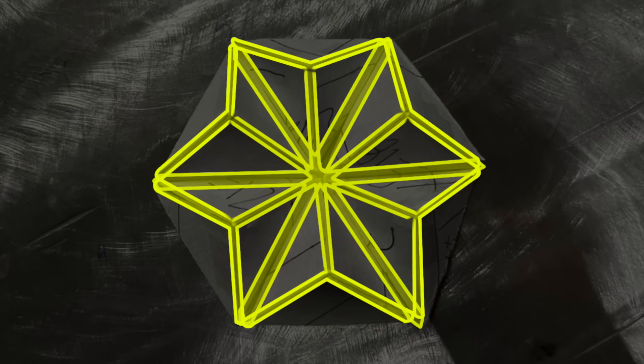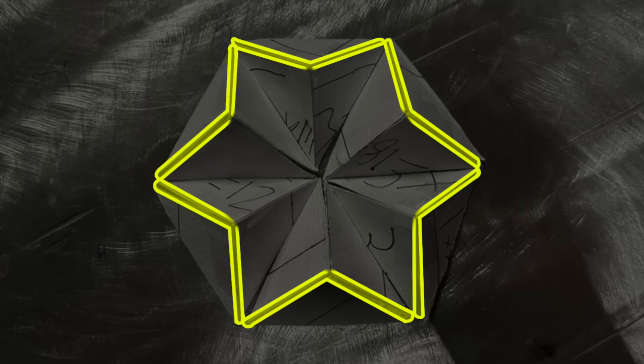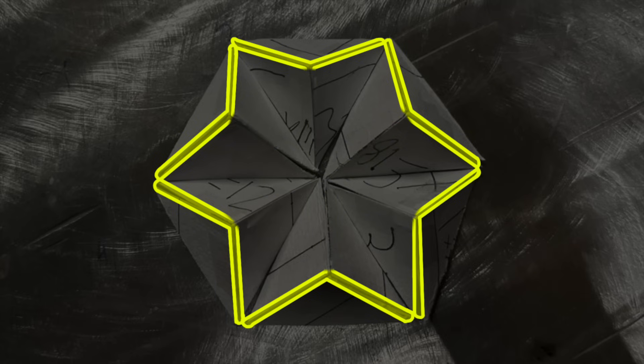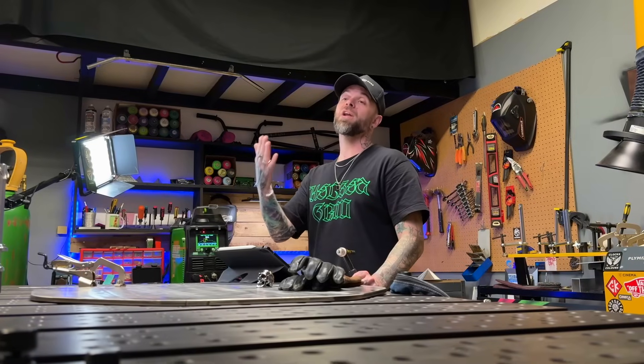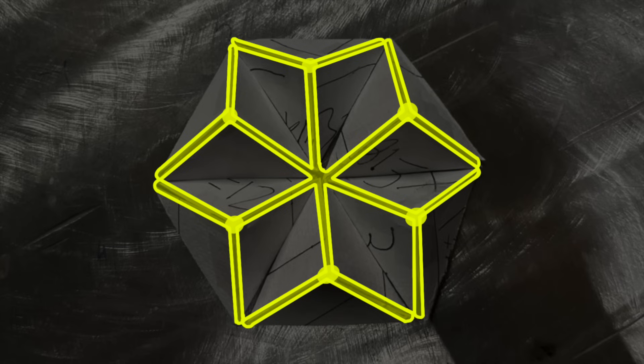First I'm going to start out with my outside corner work. I'm going to start on the outside passes and weld uphill and stop at the tip of each triangle section. Why would I start with the ones on the outside instead of the ones on the inside? I'm starting with these ones simply because the welding on the outside edges is going to heat up the most and the fastest — the stuff on the inside has more material surrounding it. So doing these ones around the outside first are going to be done before the entire thing gets smoking hot, and I'm also going to bounce around the project. I'll do a weld on one side and then flip over and do a weld on the other side. I'm starting each outside corner going up from the middle — this is going to meet the other pass on the top of each triangle, and this is where I'm going to leave the button right on the tip of each section. Doing this across all sections is going to create a lot of really cool looking symmetry.